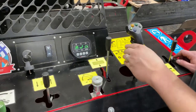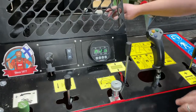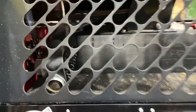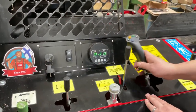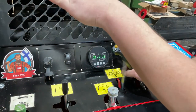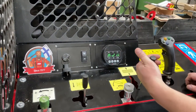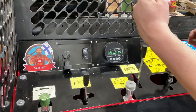The other thing here is we've got a hydraulic overhead log clamp with a freewheeling roller on it, so there's always a little bit of down pressure on that as the log is coming in. What I do when I'm infeeding is I'll lift up on it so the log will go past it, then let go, and then we can start cutting. You can also add more pressure to it if you're on a crooked log to really keep it in the place that you want it to be.